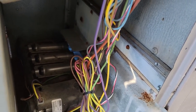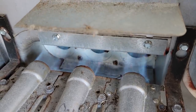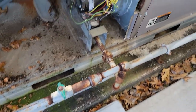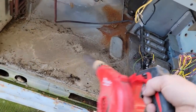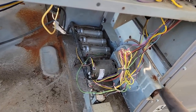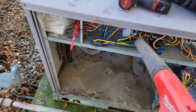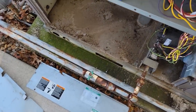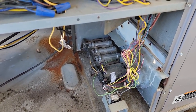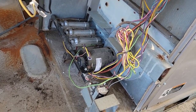There was a little bit of a pop when it kicked on — it could have maybe not ignited quite right. Let's blow those burners out, blow all this dust out of the bottom. I'm going to go ahead and kill gas to it so we don't have any problems. Let's see how she lights off now — she's probably locked out. I think it's in a retry; she'll kick back on here. There it goes — didn't make that crazy pop that time. Burners looked a little better.